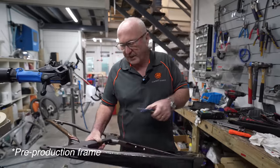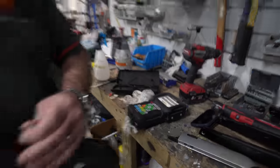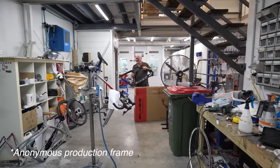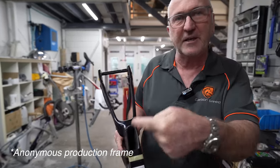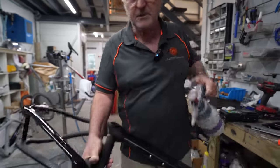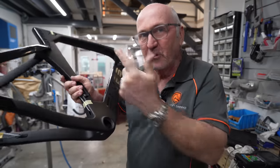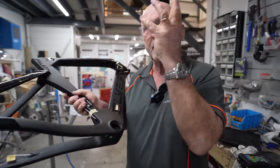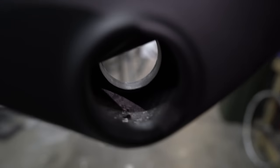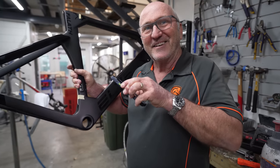So that's your pre-production one. Looking at it, it doesn't look terrible. This is where I question whether it would be all over the place — and it is. You don't for a minute think that's 0.6 thick. It shows signs of delamination, and there's not many frames you can go completely around and find no delamination. Well, that looks like they learned from what you were saying about the seat post — you can see somebody's sanded and finished it and checked the measurement. When we spray a bit of solvent, you can see white resin in there, right at the edge — it looks like there's fiberglass in there. When you drill through carbon, you can often break the back layer out — that's what that is.